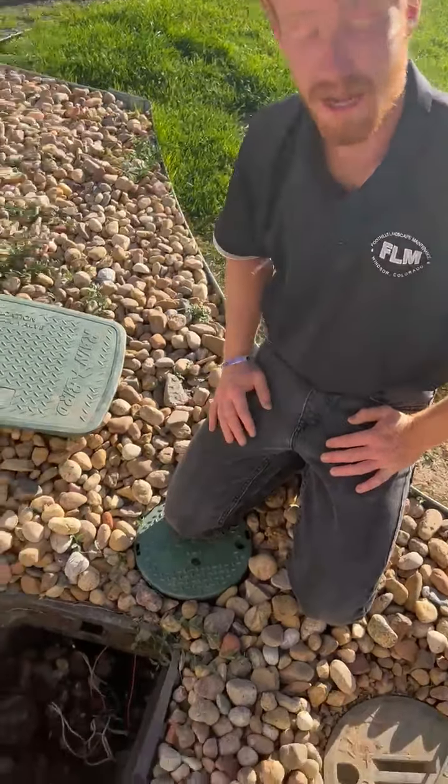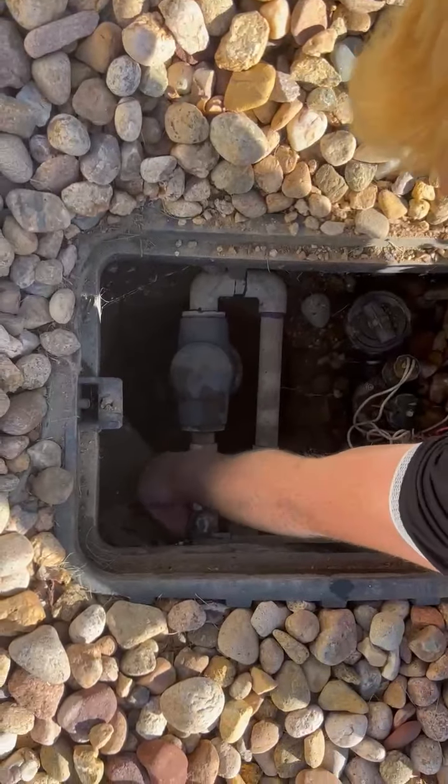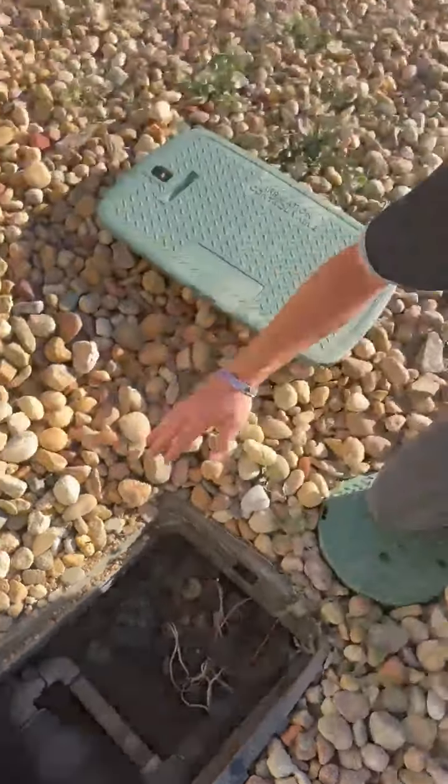On the 22nd of October, we will be offering free air. If you want to have that air, you will just go back into the standard valve box. Make sure that this ball valve is turned parallel with the PVC pipe. You will then run your clock, do a test for about five to ten minutes, and make sure by the end of it you have air coming out of all your heads, your drip, anything that is in your irrigation system.